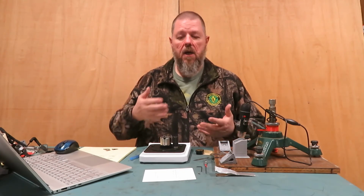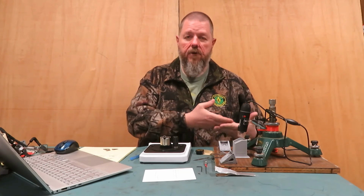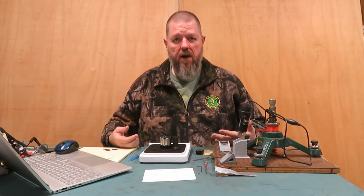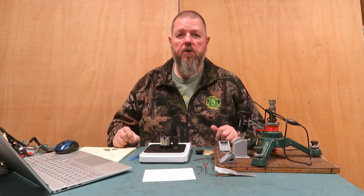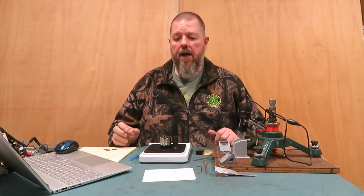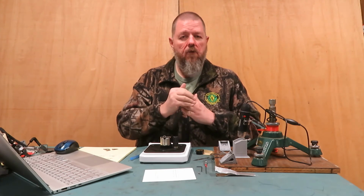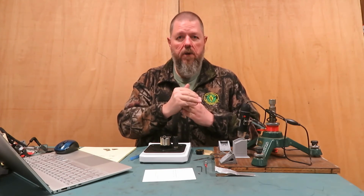The key is make sure the grit that you're using now is used long enough to remove the scratches from the prior grit. And one way to verify that is getting a burr at every grit. And again, look down in the description for those videos on getting a burr. Getting a burr means you've reached the apex and you folded over some metal. You've removed enough metal on this side that you've actually folded it over.